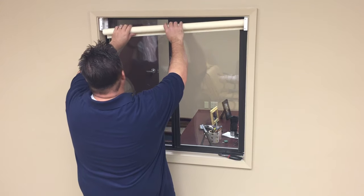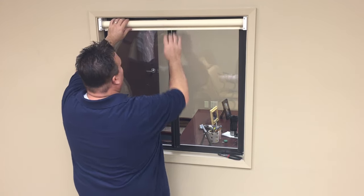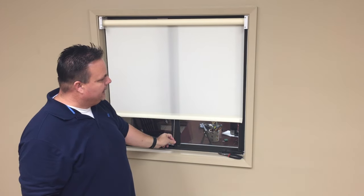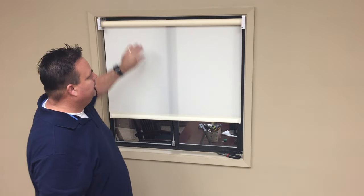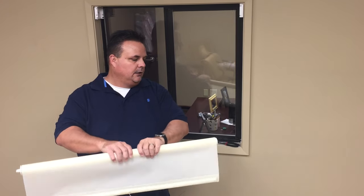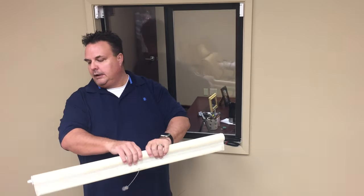What I want you to do now is to reload it — you're going to pull the shade about halfway, or a little bit more, down, right there. Then we're going to unload the shade. We're going to wind up the fabric ensuring that it doesn't overlap and catch on either the idle pin or the spring itself. We want it to be even.